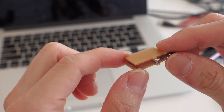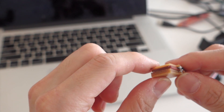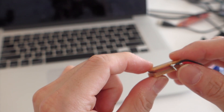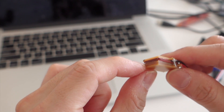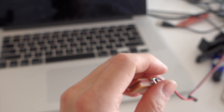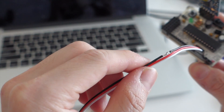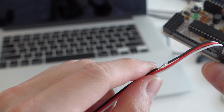This is a capacitive sensor. We got three layers of PVC and one layer is a rubber. The outside shell is the TX, the inside is rubber and RX. I have these two wires going into a microcontroller, pin 10 and 11. On pin 11, which is the TX, I have a 50K resistor.